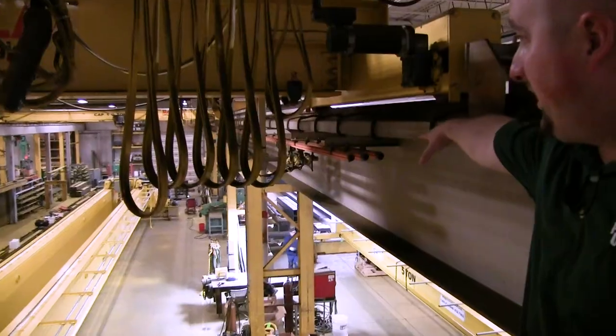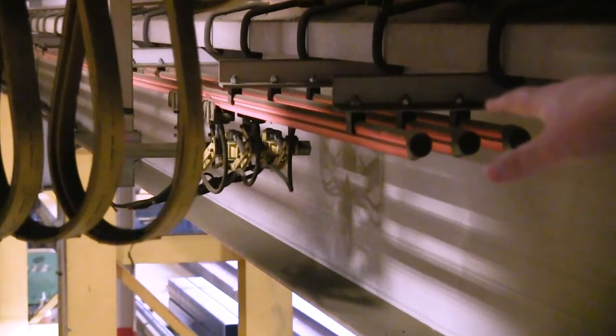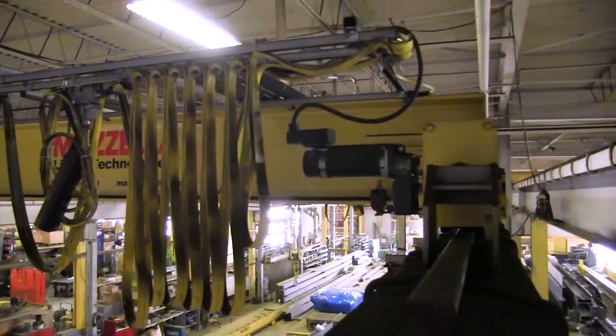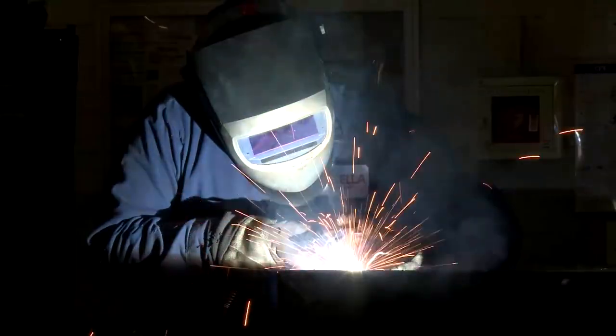The only challenge really comes down to when you're completely changing your electrification from one style to another. As far as conductor bar goes, that's relatively easy — you can add a fourth bar, since older systems only required three bars per OSHA. Adding a fourth bar or another hundred feet doesn't cost a great deal and isn't much labor. However, if you're changing flat cable or cable reel, it becomes a money issue because it all has to be replaced. You don't want to splice flat cable if possible.